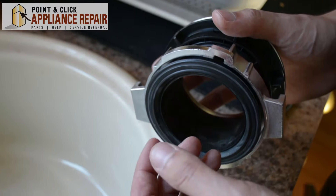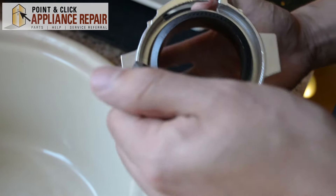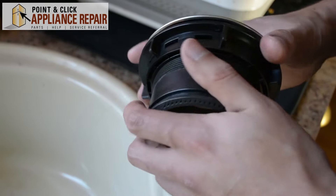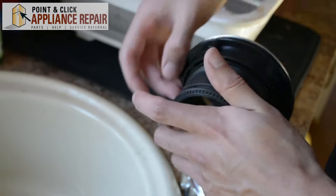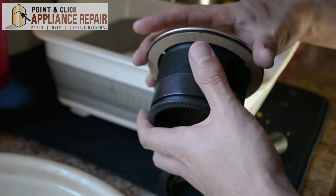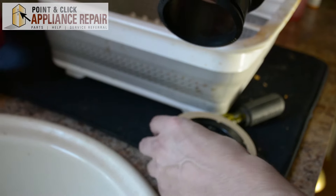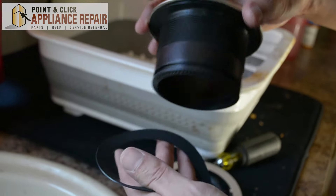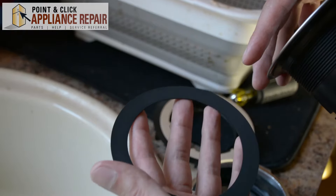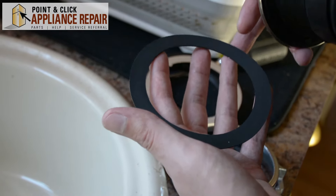Now for the flange, we're going to have to take this apart — try and remember how you take it apart. We've got this bottom piece here, this gasket — it's going to come out first. Then this metal piece comes off. Now we're going to unscrew the plastic piece here and set that off to the side. Now we've got a couple of gaskets. This gasket is going to come up underneath. And then this rubber gasket — if you look at the instructions, it says for stainless steel sinks. We don't have a stainless steel sink here, so that's why we're using the plumber's putty. But if you do have a stainless steel sink, instead of using the plumber's putty, you would use this rubber gasket, as it says in the instructions.